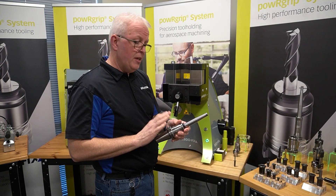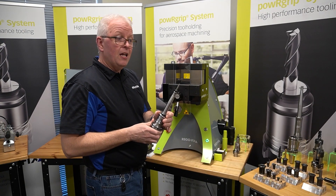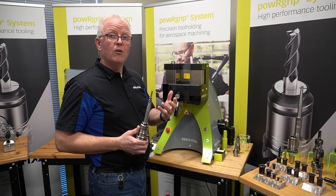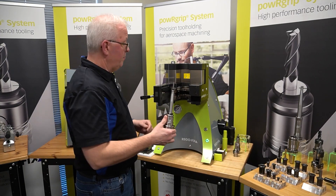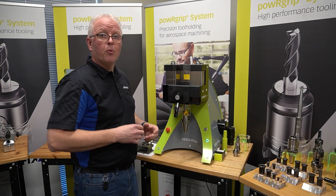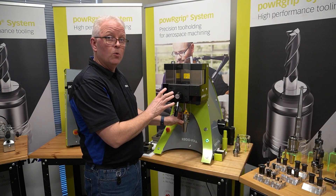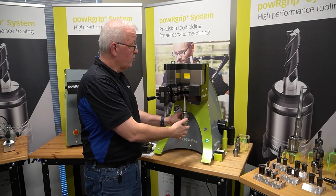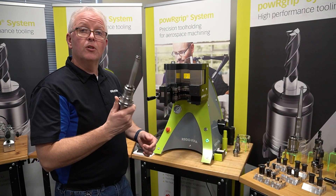While that's in the process of moving, I'm going to take my extension and holder assembly and slide in my PG-10 collet with a quarter-inch ground plug. This is not a TIR plug — it's just a ground carbide rod, so it's not going to give us probably the best TIR, but it'll give us a good idea of what we should expect. We'll put this into the PG-U, close the door, and press the press-in button. It takes a few moments. I am going to hold on to the bottom of the holder when I open this, as the PG-10 doesn't have a lot of area to hold on to with the overall assembly hanging down below — so having your hand on that is a really good idea during assembly or disassembly. This is now fully assembled.